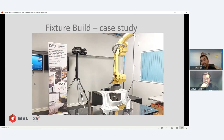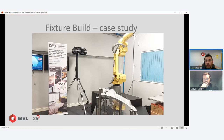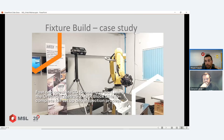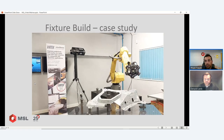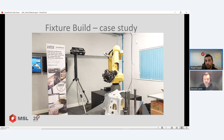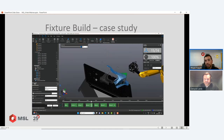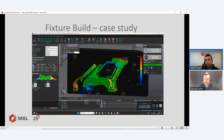The video also shows the scanning side — what we call photogrammetry. Whenever we put a new component on the tool, the Q-bar re-detects its own targets, then scans the components. This is our own challenge before we had Vertek — you'd get the ruler out to measure which length should be screwed in and find out the mistake afterwards. We're also starting to see on the automotive side a move toward modular fixturing, especially with the rise of additive manufacturing in the fixturing business — this lends itself even more to quickly changing over between different parts.